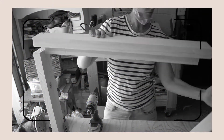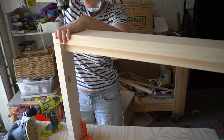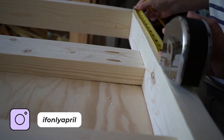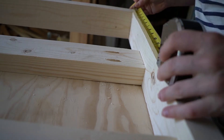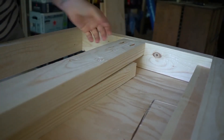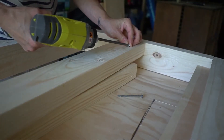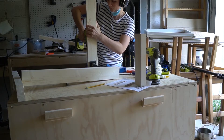When building the frame, add a connecting 2x4 board between the sides — this determines the seat height. This sofa sits about 12 inches tall from the floor. Add a 2x2 under the armrest using screws and wood glue from the bottom so it's not visible on the outside. If you use a Kreg jig, you absolutely must have the right-angle clamp — it's a lifesaver. Link below. I switched to the Kreg jig for most of the project.